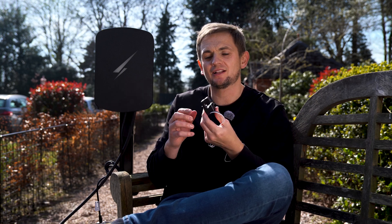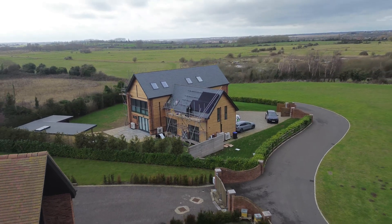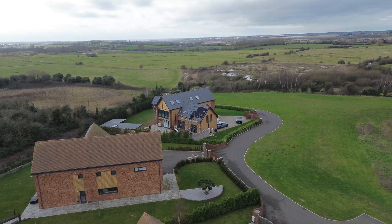Now I want to talk about CT clamps. A CT clamp is a current transformer, and what it does is measure power going through a cable — sometimes bi-directional. Why it's important for car chargers is that when you install a HyperVolt, you get one of these in the box. It clamps around your main live coming into your property so it knows what the house is doing and how much load is going in. Because it's bi-directional, it can also see export — and if you have solar on your property, you can set your HyperVolt to activate with export and charge your EV with any energy that would otherwise go back to the grid.